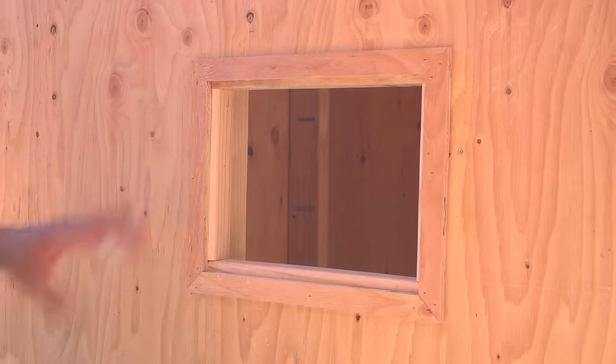For this to be a proper chicken coop, we have to have nesting boxes. The first thing we have to do is make sure we have holes that are appropriate for our hens. I create a makeshift jig — which is literally just a screw attached to a piece of scrap — and I attach my router to the board itself. All I'm using is a straight router bit, which means I can plunge into the plywood easily. Once I have my hole centered and pre-drilled, I insert my screw into the plywood, which acts as a pivot point around the entire circle. This really does provide a quick and perfect way to create a circle. If you want the hole smaller or larger, all you have to do is adjust the distance between the router bit and the screw. I then fabricate a quick rectangle out of some 2x4s, which will be the landing pad for our nesting boxes, and once I have it centered underneath our three holes, I fasten it to the structure for a stable base for our hens to lay their eggs.